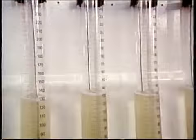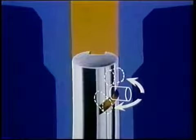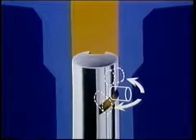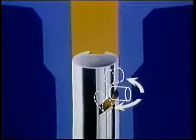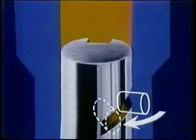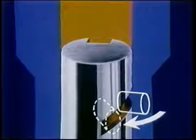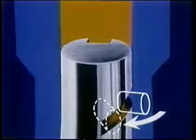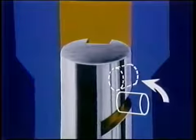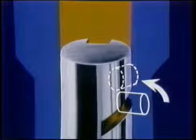How do you close the spread? You change the port openings. When any barrel is rotated, the port is turned in relation to that helix. Let's see how this changes delivery. If the barrel port is rotated like this, the plunger will lift farther and deliver more fuel before port opening. On the other hand, rotating the port the other way will cause earlier port opening and deliver less fuel from that pumping element.